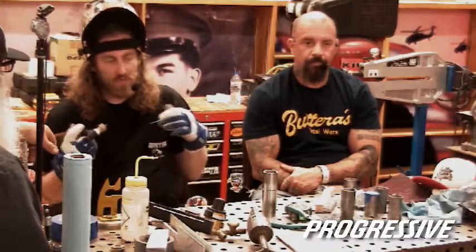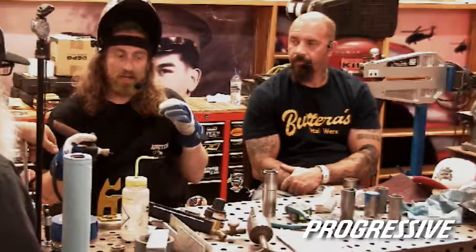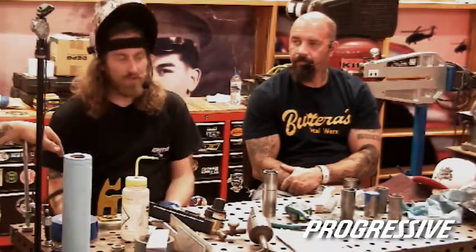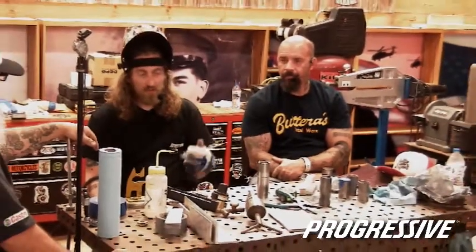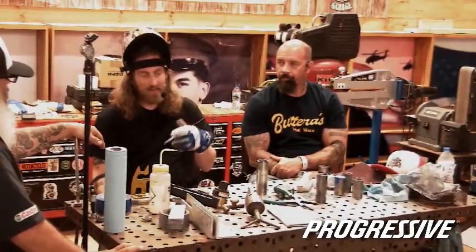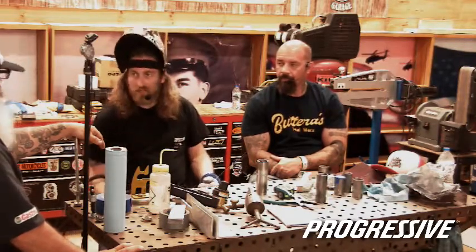Or if you do get heavy tacks, you can use that material as you're coming around, not dip, and draw it into it. Draw it around. And you can foot pulse, to try to keep the heat out of the part. You can get used to pivoting your foot. And it all comes down to what machine it is and what you're used to using.